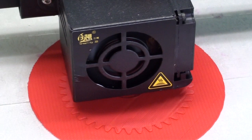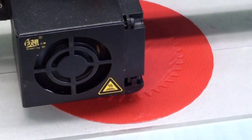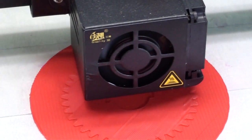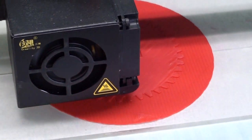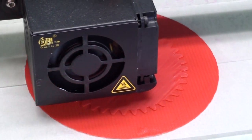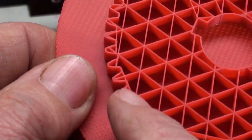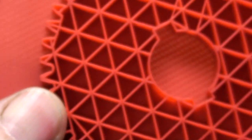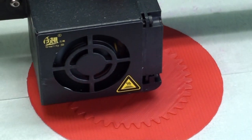It is a slow process — it takes about nine hours to print one of these out. I usually start it up just before bedtime and it's done when I get up in the morning. People have told me it isn't necessary to have 100% fill, that I can get by with 20% as long as I have plenty of layers on the outside where the teeth are, because I could not get away with hollow teeth — they would shear off. I do break some of these in that video I mentioned, so check out Tips 416 if you will.